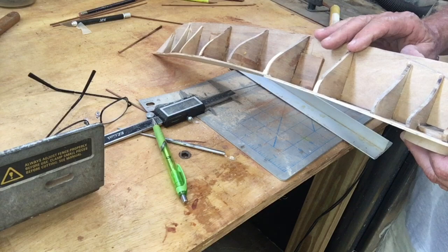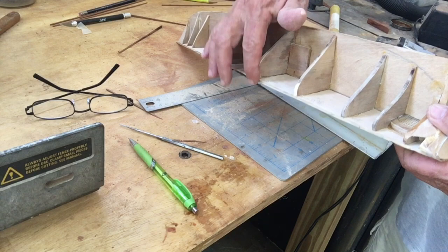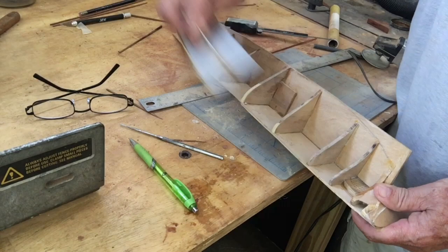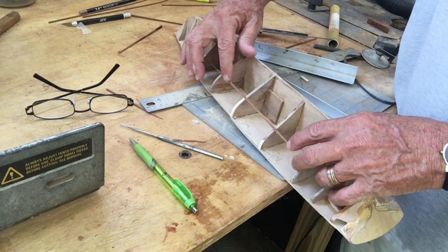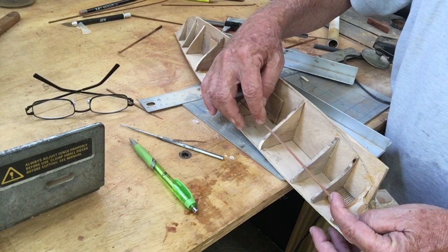You will notice that I didn't cut the frames properly, and when I put the caliper on either side, I found there was a difference, and so I had to make up the space. So I laminated pieces on at various parts and then used a flat sander to make sure that the pieces were flat and that when stuck they would have this flat surface I just referred to, because the board needs a nice stressless attachment to the frame.